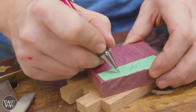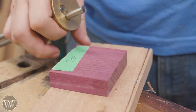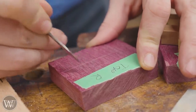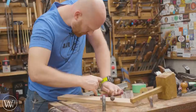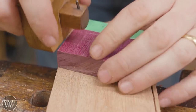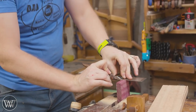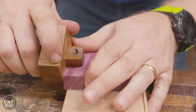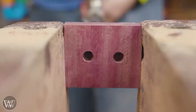At this point I want to make sure I mark all of these and know exactly which way is up on all of them so all the joints match. We're going to do a very similar layout here — this marks where the top of the board is. Once I have that in place I can lay out the board and transfer. That way I can put the marks exactly from the pins into the board. I set up the pin on one side, take it around the board and mark it from the other side — that way I have the exact same marks all the way around. Here you can actually see the reversing grain on this purple heart: the bright stripes are where the grain is going with it and the dark stripes are where it's going against it.